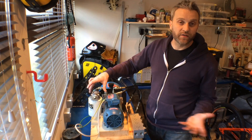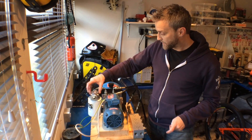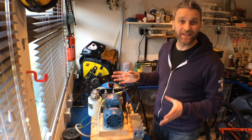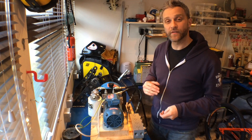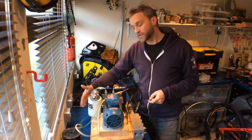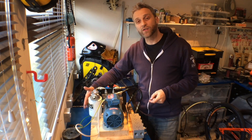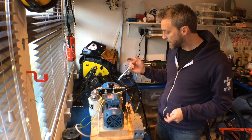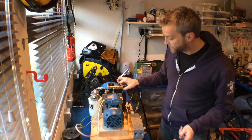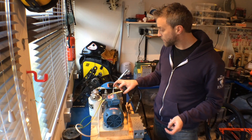I've added quite a large filter - I couldn't find a smaller one, but I happen to have the fittings already because with hydraulic fluids you really need to keep them clean, especially when working with servo valves which are very fussy with oil contamination. I think this is a 10 micron filter. There's a check valve down here - pretty much it at the moment, it's going to be a fairly simple rig to start with.